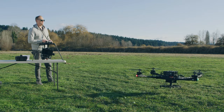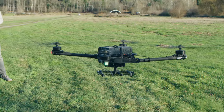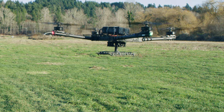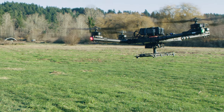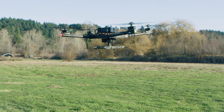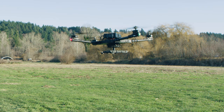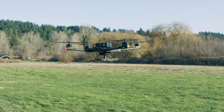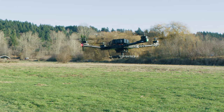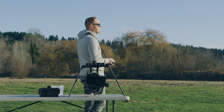Then I'll slowly idle up. With no payload, this will lift right off the ground. As the props come up into plane, I'm checking to make sure that everything looks like it's tracking well, everything looks smooth. Looking at all the wires, making sure there's no vibration, nothing weird going on. I'm looking at the boom LEDs to make sure they're not shaking. Just doing a last little visual check before I start flying around — all the boom struts are engaged, everything looks good, it's responding nominally.